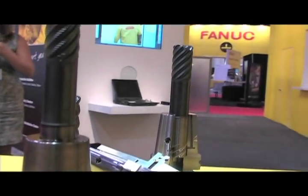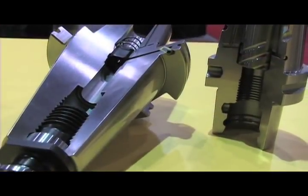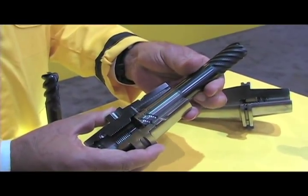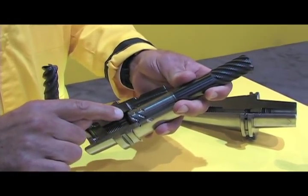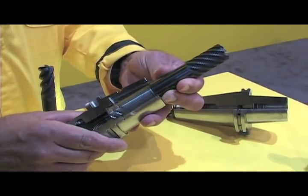He's going to tell us a little bit about the Phoramil Plura with ILOC system. We're actually introducing next year not just a new end mill, but a whole new milling system. The new system is a combination of a holder and the Phoramil Plura cutting tools. What we've done is we've added a groove system and pins in a shrink fit holder with ILOC technology to hold the tool in and keep it from pulling out.